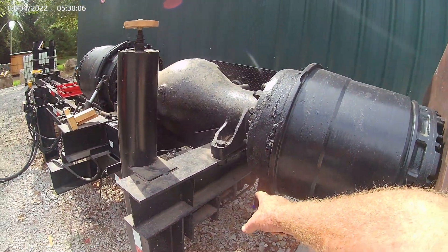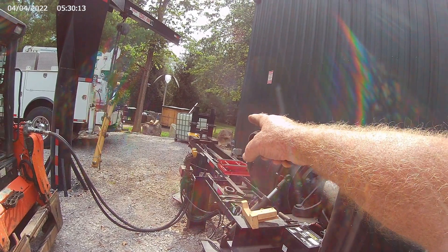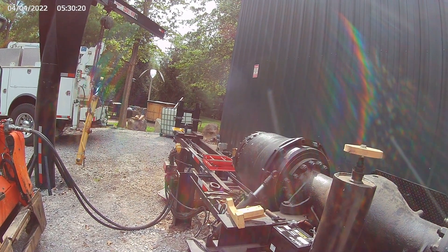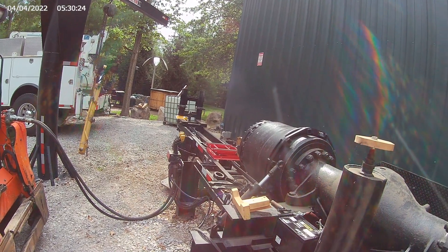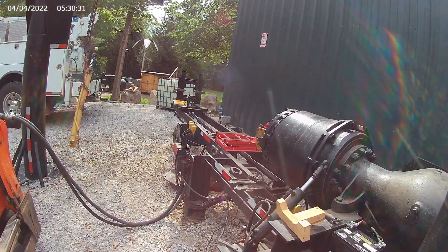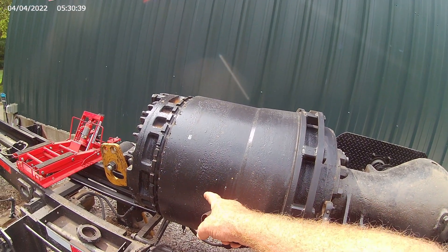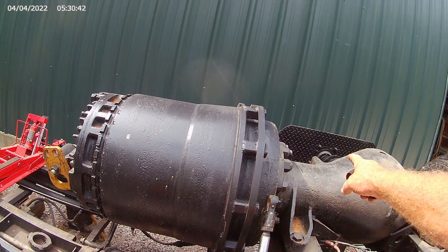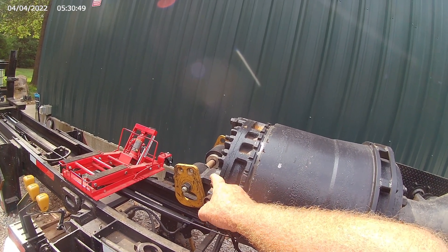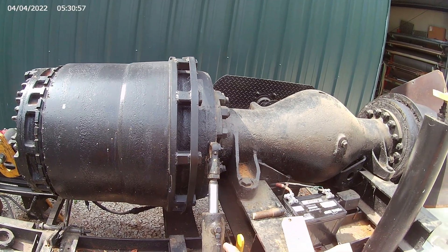Down here I've got an electric 12,000-pound winch. I use a Komatsu three-stage forklift mast — a forklift mast normally only goes up and gravity pulls it down, but when it's laying sideways like this, I use hydraulic oil to shoot it out and the winch to pull it back, which works really well. This is my crutch cylinder. My gear reduction on the rear end is 23.5 to one, so at a thousand foot-pounds I can deliver about 23,500 foot-pounds of torque. And if I want to up the ante, I can use the crutch cylinder and get pretty close to 60,000 foot-pounds.